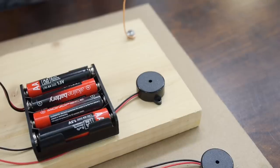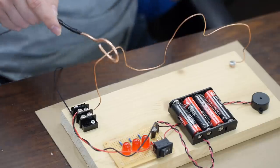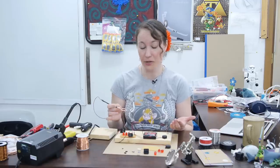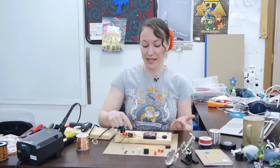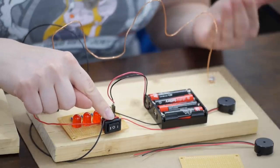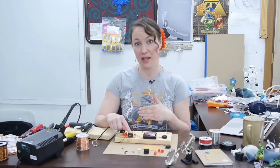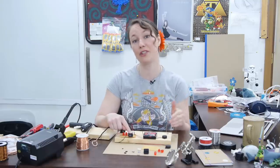I designed this game with the traditional buzzer and with a silent mode with LEDs. The two wires act as a switch opening and closing the circuit. There's a second switch here which allows you to select the mode. It's a single pole double throw switch that's on-off-on, so you can select either mode but still turn the game off.